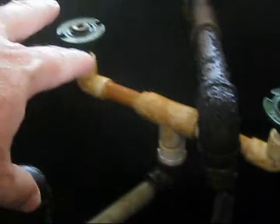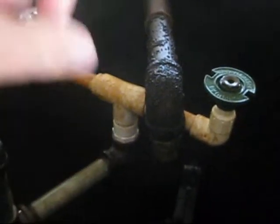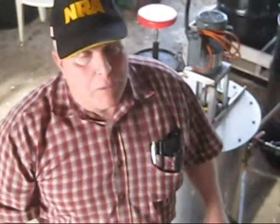We're looking down inside of the tank. That's your coil down there — your heat exchanger coil. And then these are the sprinkler nozzles — two of them — and they're what washes. The water sprinkles up and washes down through the reacted methyl esters, rinsing away any impurities. The impurities are basically soap particles. This process is also known as transesterification, which is a process used to make soap. So you end up with some soap particles floating freely in the methyl esters, and also some free methanol we want to get out. The water bath does both of those jobs.